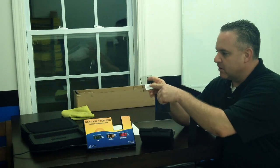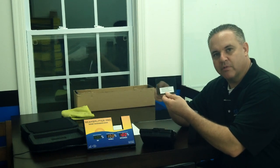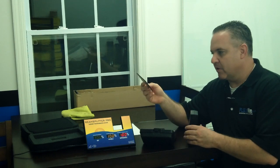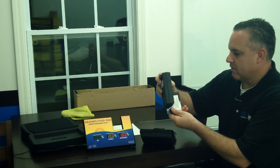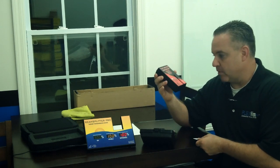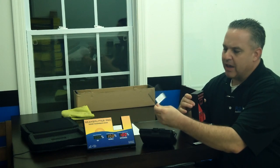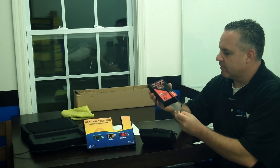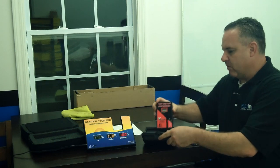These glass slides come with the Laser Labs meter and have been predetermined to specific VLTs by Laser Labs. This one is supposed to be twenty-eight percent and this one is supposed to be eighty percent. Let's see how accurate this meter is against Laser Labs' own specifications. The twenty-eight percent slide reads twenty-nine percent — off by one. The eighty percent slide reads eighty percent — accurate. So the meter has a slight offset on the lower slide.